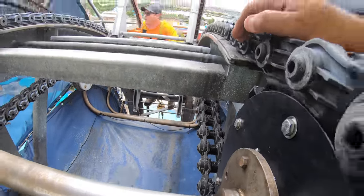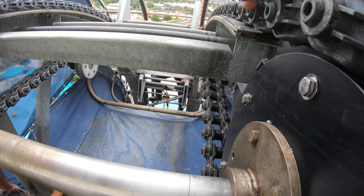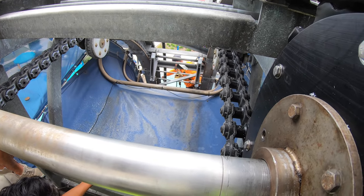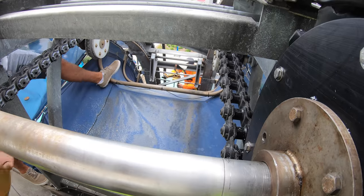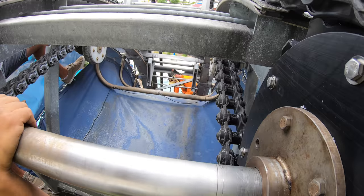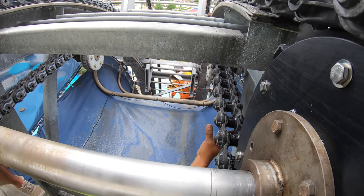And remember, whatever you bring up to your tower and onto your conveyor, you need to take it down, because if you don't, there's a possibility that it's gonna get caught in the chain or on one of the rafts or the cleat, and that's a no-go. Make sure you're taking everything with you that you brought up. And if you have extra parts that you broke, make sure you take those down with you too.